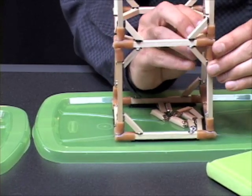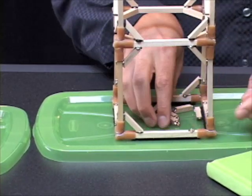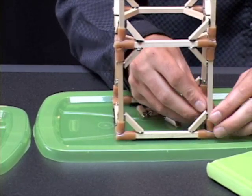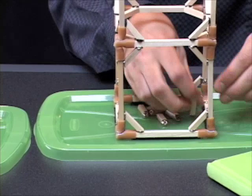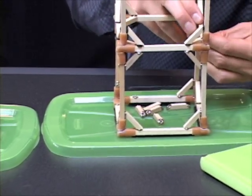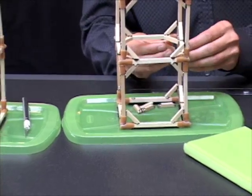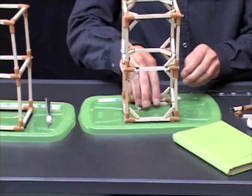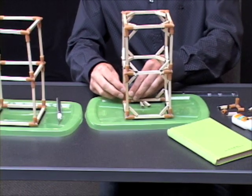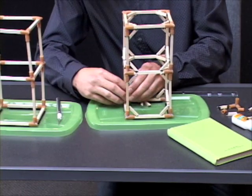These supports act as either a reinforced concrete column beam connection or a steel I-beam with a weld would act. They reinforce the corners, which are most susceptible to damage during an earthquake. And since the corners are also what holds the building up, if they are damaged during an earthquake, the building is more likely to collapse.